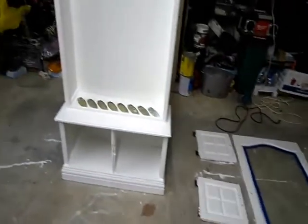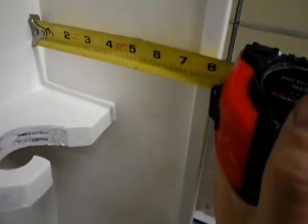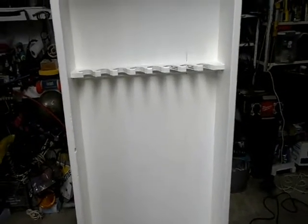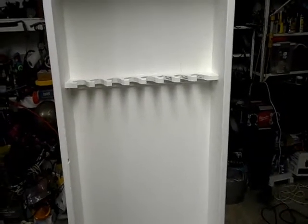Welcome back. Today we'll hopefully finish the gun cabinet to curio cabinet conversion. The first thing I'm going to do is measure out for the shelves — how deep the shelves need to be. It's about seven and a quarter inches, so you can't just buy a piece of wood that size at the hardware store. I'd recommend getting a one by eight and cutting off three quarters, or using particle board shelf material and stripping it down to the right thickness, then cutting it to the right lengths.